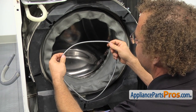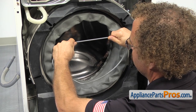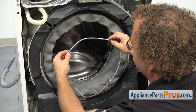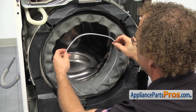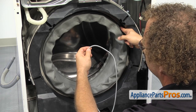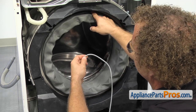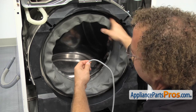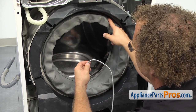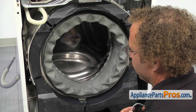When you put the spring clamp on, you want to make sure that you don't over-stretch it — otherwise, you'll ruin the spring. You only want to stretch it out about that much so it goes around the whole area and seals everything. As you're putting it in, you have to make sure you stretch that amount evenly around the whole spring. You don't want to try to stretch one side a lot and the other side not at all. If one of these sections slips and you let the spring retract, you're going to have to re-stretch it before you put the next one out; otherwise, you're going to get around to the bottom and not have enough spring left to get it stretched all the way around the seal.